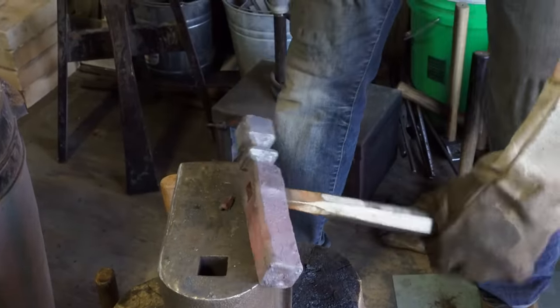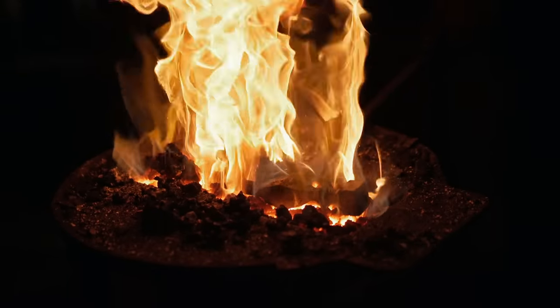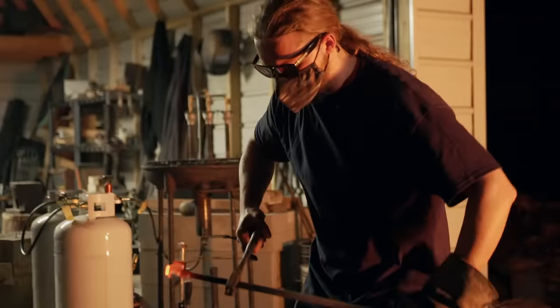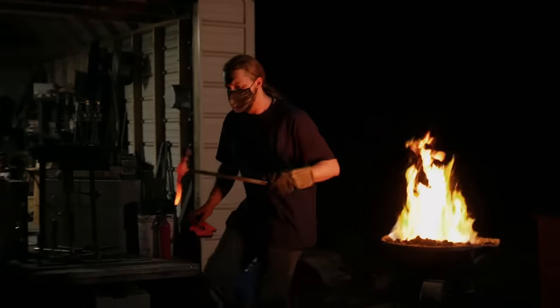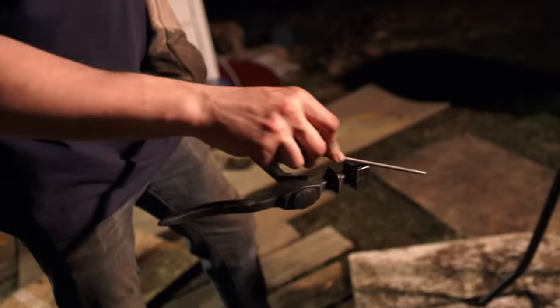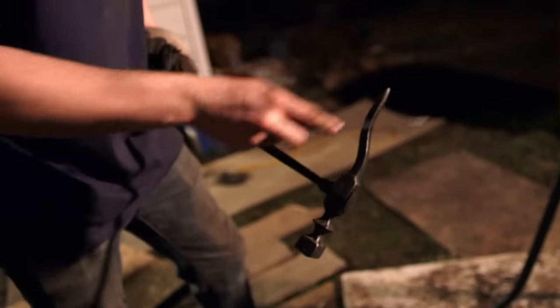The biggest concern for today is getting the eye of the hammer punched. If the eye ends up being crooked or doesn't punch cleanly, then I'll never get a good handle fit — it might come loose. So getting the eye punched went pretty good. I'm really happy with it, and it's ready for the quench. This is really critical for the strength of this. And repeat that for the spike. See that skating on the head? Skating on that spike? Just what I want.